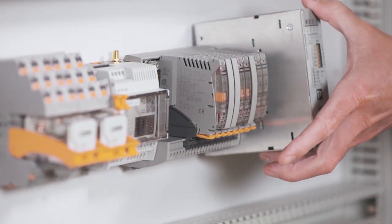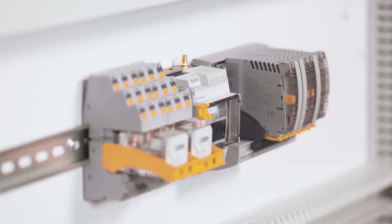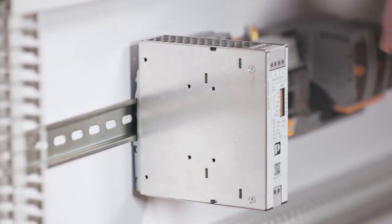In just a few seconds, I've mounted all these different components. Way back in the day, these components all would have been individually screwed or bolted to a panel — you may have heard the term panel mounted. With that, you need to tap and drill bunches and bunches of holes, adhere them back to the cabinet, all of which takes lots of time, lots of maintenance, and frankly lots of money. Plus, if you get the order of components wrong, you can just pop them off and rearrange them as necessary — no need to re-drill or re-tap anything. This easy installation, removal, and maintenance is what makes DIN rail so appealing, and why you see it in nearly every modern industrial cabinet.